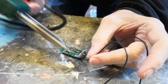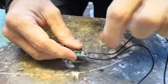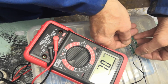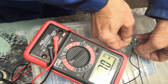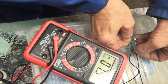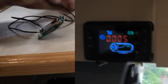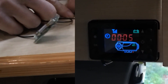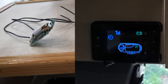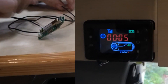I'm going to add two more wires onto the battery terminals to get the supply in, but I'm going to just test it with the battery to start with. Connecting those two wires now to the multimeter - I just want to make sure that switch is still good. Press it down, the little micro switch there I marked up - yep, good, got continuity. Excellent. So in the van - there's the LCD controller on the right, the remote on the left. Let's touch those two wires together. The blue LED's come up and the LCD controller's fired up. Rock and roll - we're in business. I think we've hacked that remote successfully.